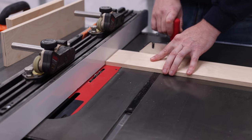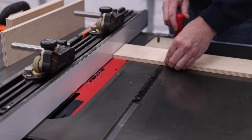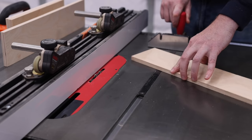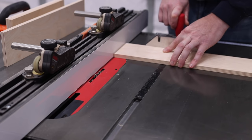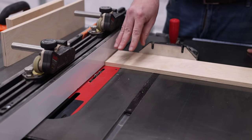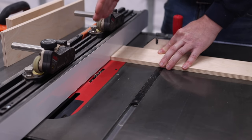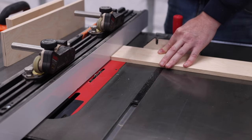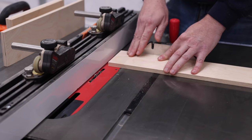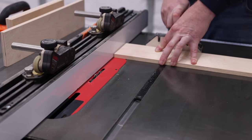The first cuts I'm going to make are the dados in the side pieces. To make those dados, I'm using my stock miter gauge, sliding it up against the fence. Before everybody freaks out — hear me out. I'm pushing this through, flipping it around, and making the same cut on the other side. I'm not removing a sliver of material between the blade and the fence; I'm cutting a dado that is 6mm high, 6mm away from the end. There's no other practical way to do this without a spacer block workaround. So let's make the cuts.